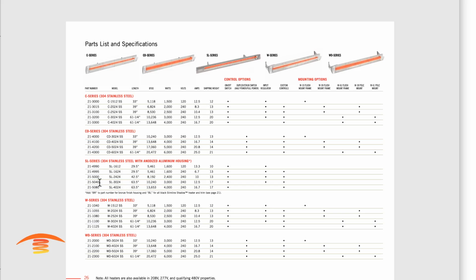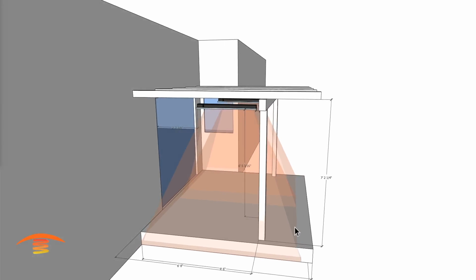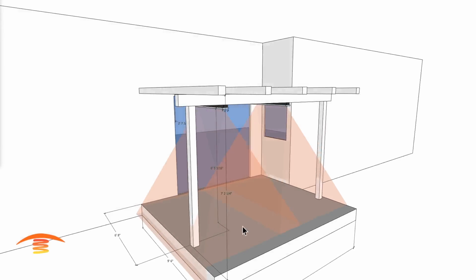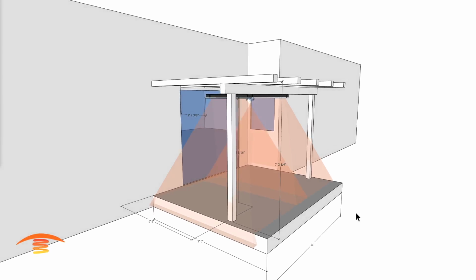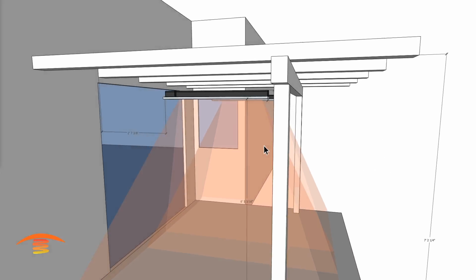Yeah, so this is the Slimline 2424, and that's the 8,000 BTUs. So that's going to give you about as much heat as you would need. And you can see I'm cutting off because the footprint of heat just doesn't travel properly at this mounting. I would like to push it out a little bit further, but I can't because of that beam. So this would give you really the proper amount of heat for the average consumer, I guess. I'm kind of gearing this off of temperatures out here in Southern California. This temperature here gets probably a little cooler. You may want a warmer unit for that purpose alone, but in any case, there's that.